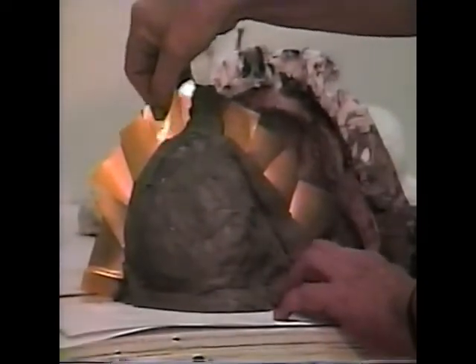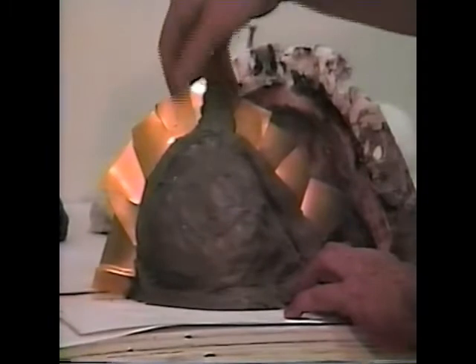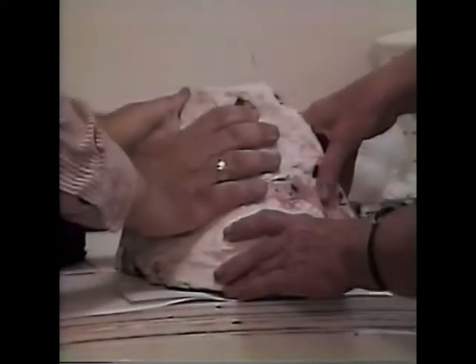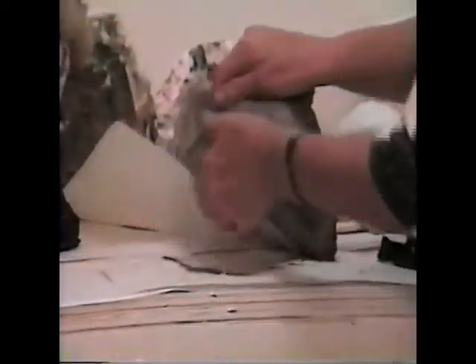These are called shims, and they're put in as dividers. They're very thin metal. So I've covered this plaster with clay, and this is what it ends up like. Imagine it came out of there and was smeared on here — it's dry. I'm taking it apart: one part, the other part. I am then removing the shims and taking the clay off.